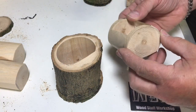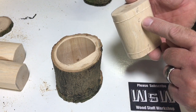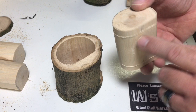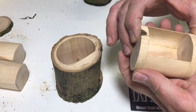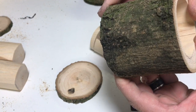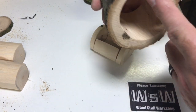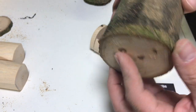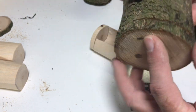Next is to glue these together. All I've got to do is make sure the F's are aligned for the front — and there's the back of the drawer — so I've just got to get some glue on these, clamp them up, and leave them to dry. Then we've got to glue this joint and clamp that together, and we need to put some glue around and glue the back on as well. I'll just keep turning it until I get it in the right position.